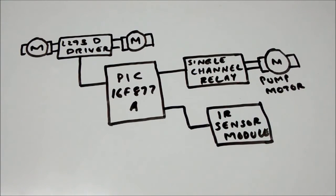This is a block diagram of my floor cleaning robot. My main controller is connected to a L293D motor driver, which is on the left side of the block diagram, and that L293D driver is in turn connected to two DC motors. These two DC motors act as my wheels, and the forward direction, the backward, the turning and everything is controlled via this L293D driver.